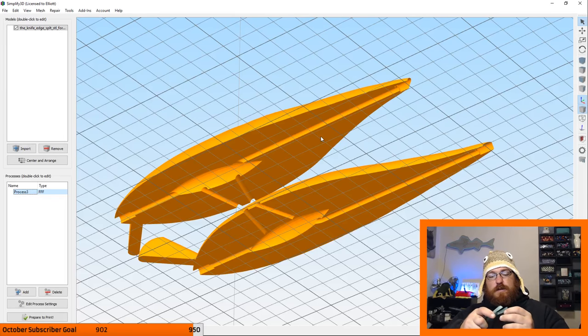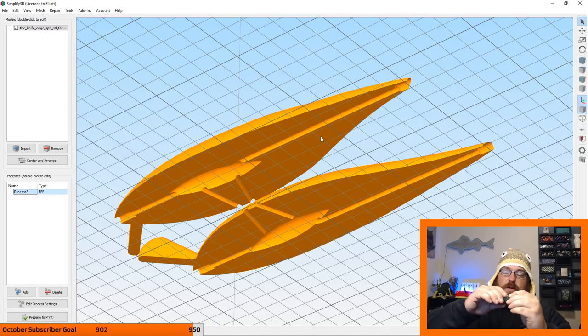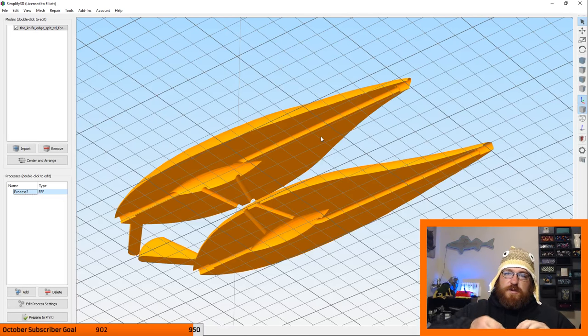It's not the most difficult thing in the world to line them up. Usually what I do is I take one bill and then just pop it on there. I don't use the accelerator for the super glue when I'm lining it up, because it's just so fast that you'll get a misalignment like that. And before you know it, you're done. It's throw it away, reprint it.